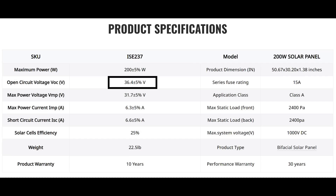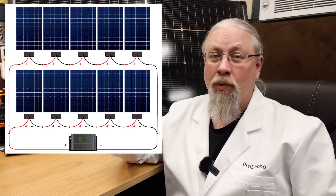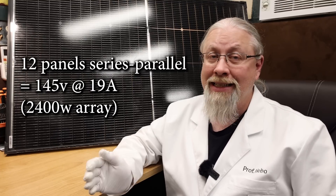The open circuit voltage, or VOC, is 36.4 volts, with the max current, or IMP, at 6.3 amps. This means you can run up to three of these in parallel for 19 amps on a standard 10-gauge, 20-amp MC4 cable. You can run as many in series as you like, up to the max input voltage of the solar controller or power station you're charging, or 1,000 volts, whichever comes first. Many modern power stations and larger solar controllers can handle up to 150 volts input — that means up to four panels in series, because when you put panels in series you add the volts together. Four panels would be 145.6 volts, and if you combine 12 panels in series-parallel, you'd have a 2,400-watt solar array running at 145 volts at 19 amps, maxing out most EcoFlow and Bluetti solar generators with 150-volt MPPT inputs.